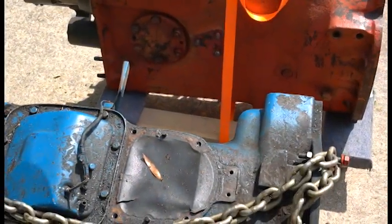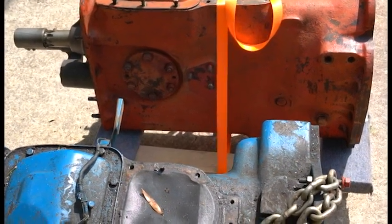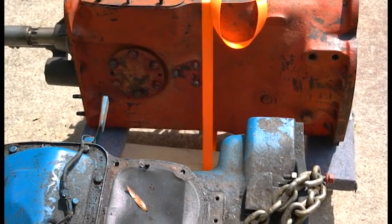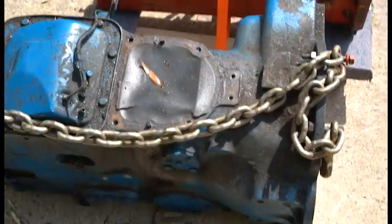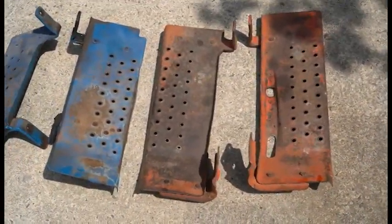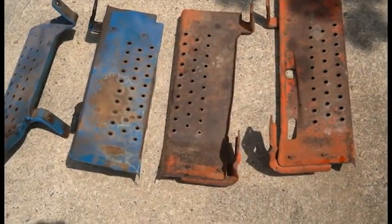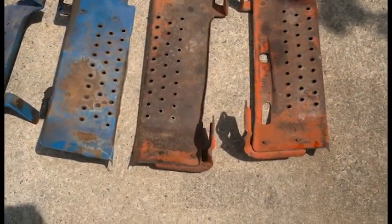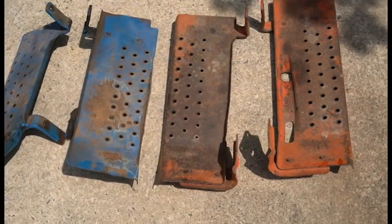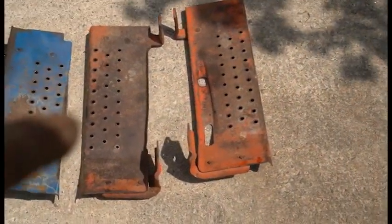The running board will mount right there on that little triangle. If you're wondering, yes that is where a radius rod would go, but since both of these are off row crop tractors there's no socket for the rod. The short studs are on the new transmission and nothing on the Selecto Speed. Looking at the two brackets side by side, the left-side running boards are entirely different — there's the bracket issue just like the passenger side, plus the Selecto Speed one doesn't have a provision for the clutch rod to go through.